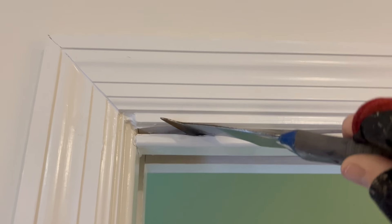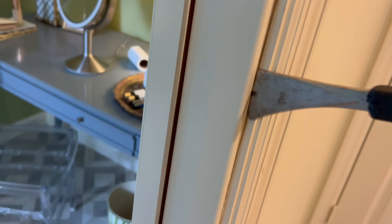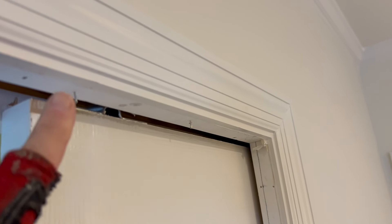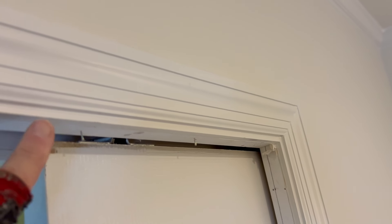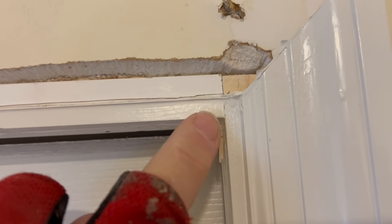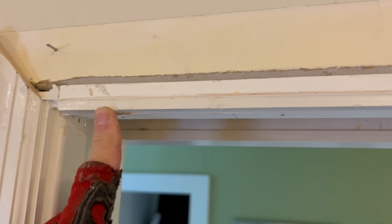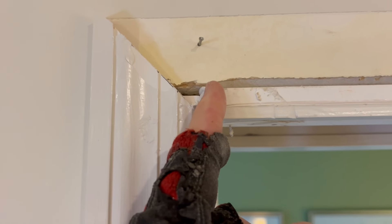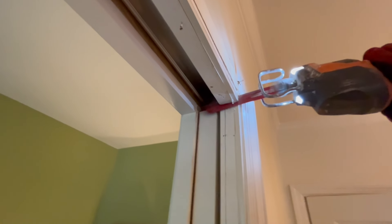As you can see there's no way to get up in there — this piece of frame has to come off. In order to get this piece of frame off we have to take the casing off. You can see the frame ends right here, and the frame ends right there. This is not structural, it's just cosmetic — it holds things in place. So what I'm going to do is put a metal cutting blade on the reciprocating saw and just cut these nails out on each end, and this thing will come right off. Now we have complete access to the wheels and the door.